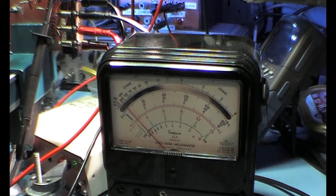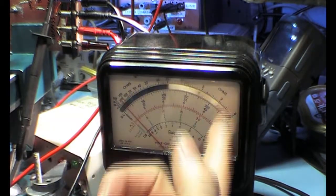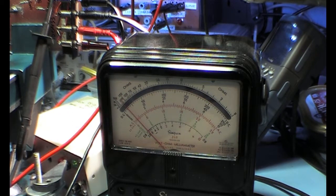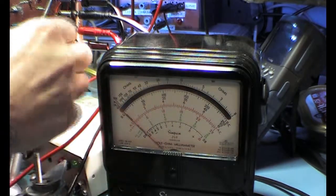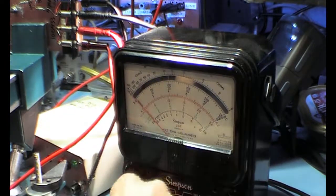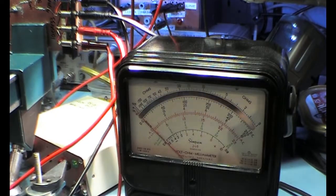They won't make it as wild as in this case, because they designed the thing. They know that it is going wrong. So in that case, they say you should use the vacuum tube voltmeter, and that will give a reading that will be close to that of the Fluke 77. So these are the things you have to look at when you're measuring high impedance sources, because the readings will be way off.